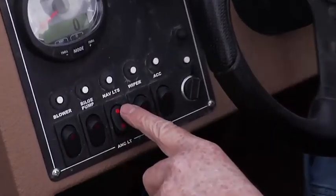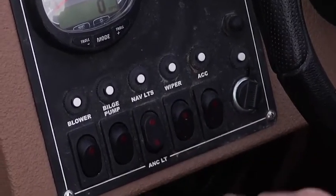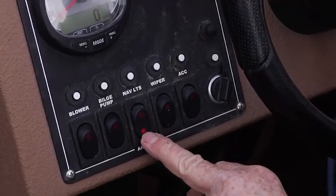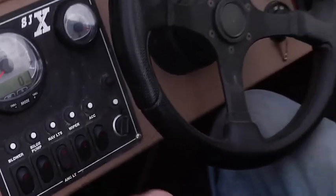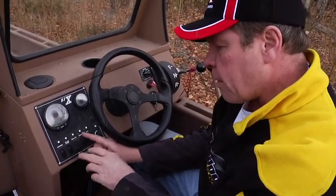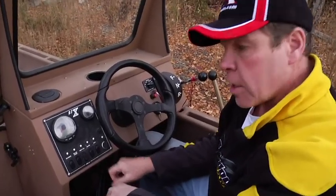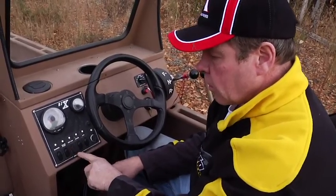You have navigation lights on the side of the boat — Coast Guard required. Up is for your running lights, middle is off, and down is for your stern light, which is for when you're anchored up so other boats know. It's important to leave this in the middle position when not in use. If you have young kids and they play with the switches and leave the lights on, come Memorial Day your battery could be dead. So leave that off.